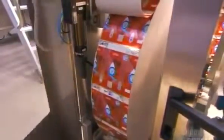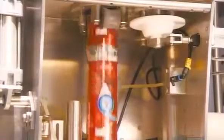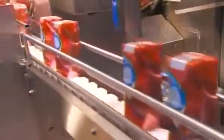At the packer's plant, an operator loads the roll of flat packages into a filling machine, built and installed by Tetra Pak. Tension rollers guide the material into the filling machine, where it is sterilized. The machine then forms and seals the material into one continuous tube. A little further down, the machine fills the tube with product. It then cuts the tube into individually sealed packages and drops them into a chute for folding. It ejects the finished packages onto a conveyor belt and sends them on their way to the customer.